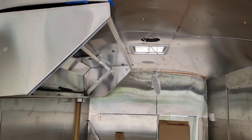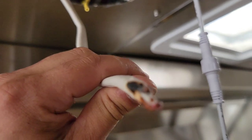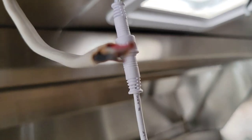There's a can light that we took off, which is always nice to have accessible. And right through here, if we stick our hand there, that little yellow cable should be there. There it is. So with this, we'll attach that Romex. That's a 14-3. We're only gonna use two cables, being the black and the white, because that's gonna be our switch light. Come on, focus in, baby.